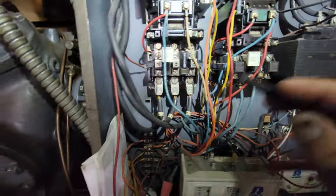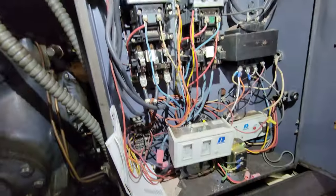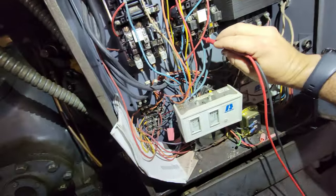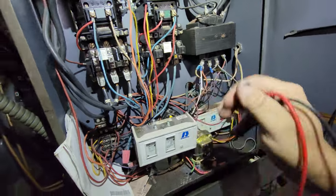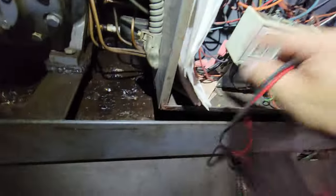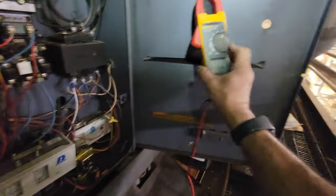It's not a light, but it's like a fluorescent. The other one I believe is the compressor. What we're going to do, we're going to clamp this thing and see what kind of amperage we're pulling. Nothing on the bottom, so we should be okay to move these wires a little bit. It's always good when you see wires that are kind of wire-nutted and stuff. Let's see what we got in the old amp range here.